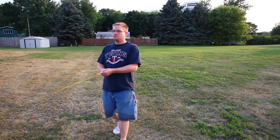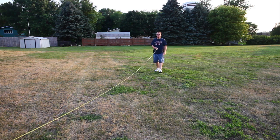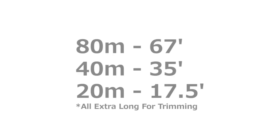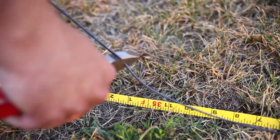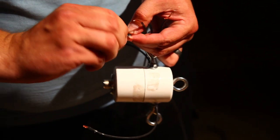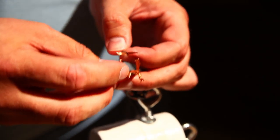The next thing to do is cut the elements — 65 feet. We cut them extra long so we can trim them later. The longest wire will be on top and holds up the bottom wires through some spacers made from lightweight half-inch CPVC. We tend to use number 14 stranded wire for semi-permanent antennas because it's strong and a little easier to work with than solid wire. A 100 foot tape measure is almost essential when building wire antennas for HF. It's flexible and doesn't have a spring retract mechanism to get in the way. When using it by myself, I tend to tie the end to the wire and then attach it to a tree or a fence post.